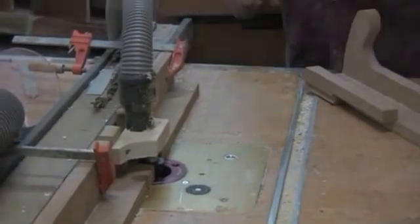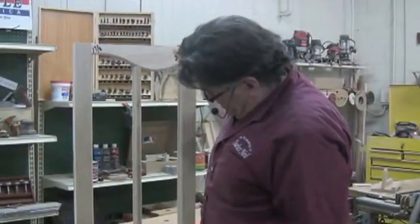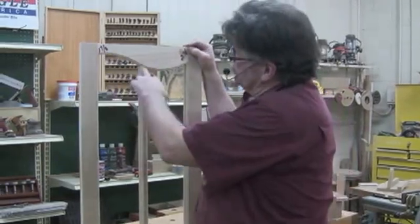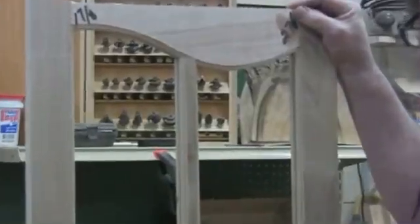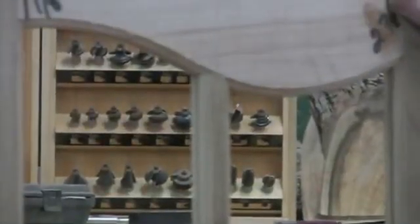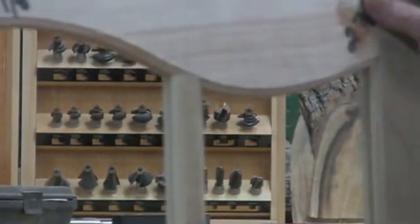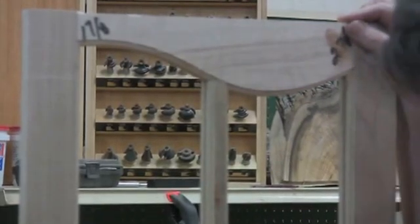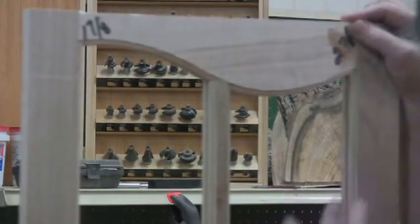Good to go. All right, fitted up a door. Now, you're going to notice something. I'm just a little bit short here. So that's the reason I'm telling you always do a mock-up to make sure you get it right. I could probably go ahead and go with this, and the reason is I'm going to be trimming it back to create my gaps when we finalize it. That gives us our basic door.